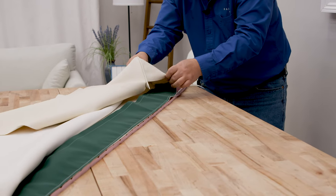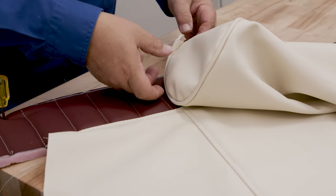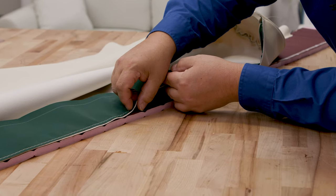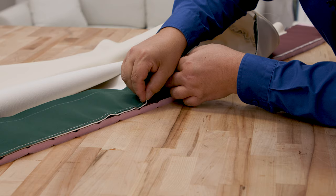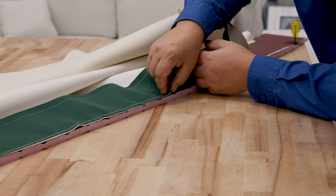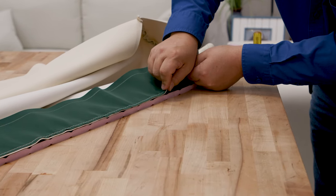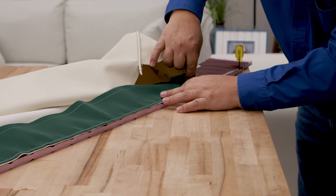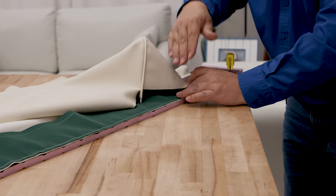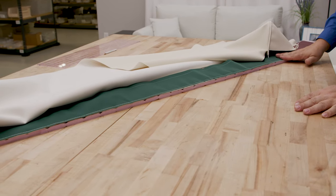The piping goes outside this seam here, so we're going to shrink this up and peel it up — that's the beauty of this double sided tape. Since we need to shrink it up, I'm going to create very small wrinkles in this assembly as I'm basting. If I were too short I would pull on this, but here I'm a little too long. These very small wrinkles should make my difference and they won't be noticeable in the end results. We're perfect now. I'm just going to push those down — they're distributed evenly along the length. Now I'm going to staple along this edge about every six inches just to keep it in place.